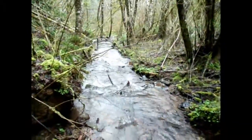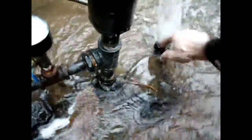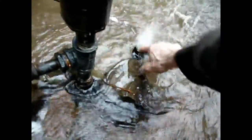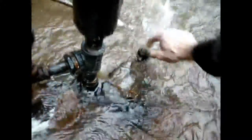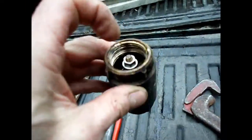Back to the pump over here. Let's go see what it does. It's got a lot of pressure in there — it might just take a little bit. It looks like I've got a stuck check valve maybe. Damn it. I'll come back here in just a second — there's a problem here.